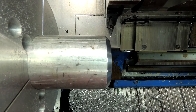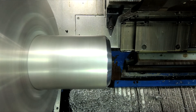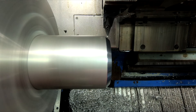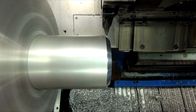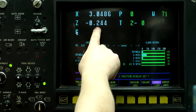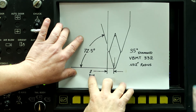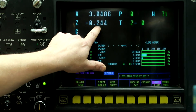What we're going to do is start up the spindle and move Z until it touches the work piece. Right about there — we went in a little too far. Then stop the spindle. The number we need to account for is 244 thousandths for this Z dimension right here to the front edge of that radius. So 244.